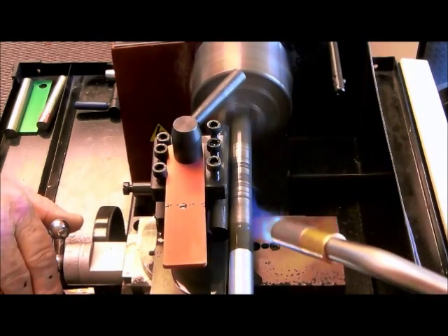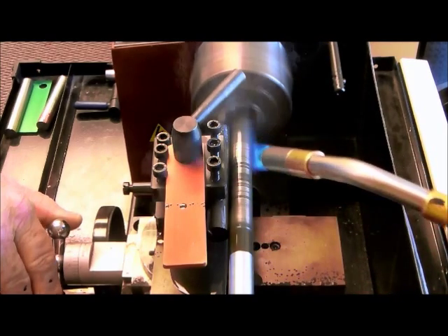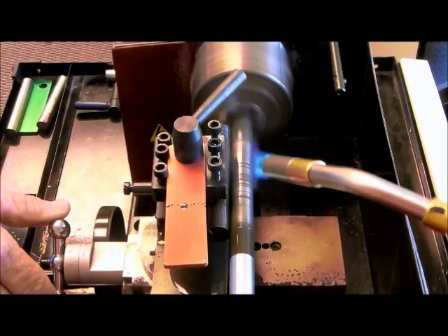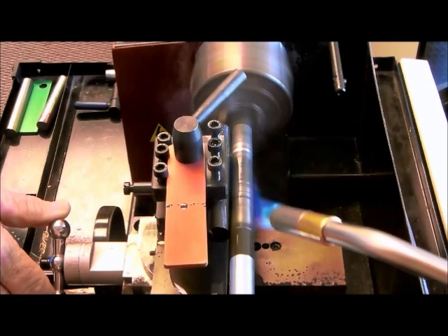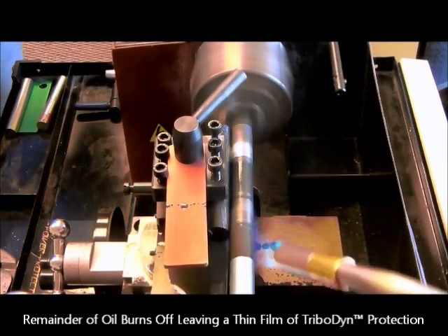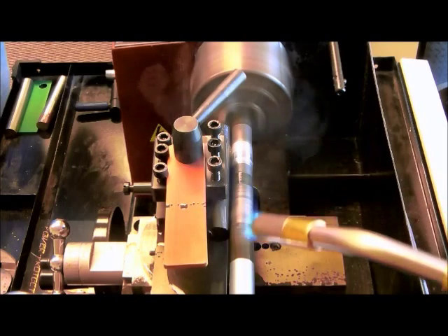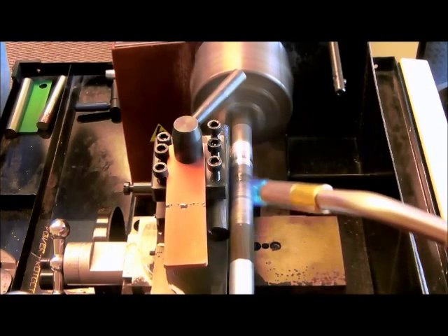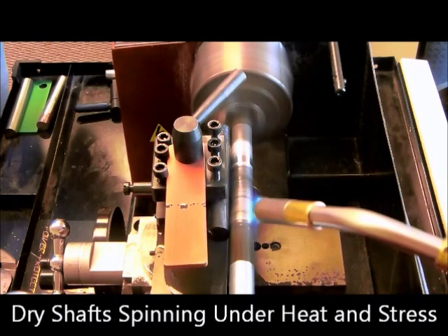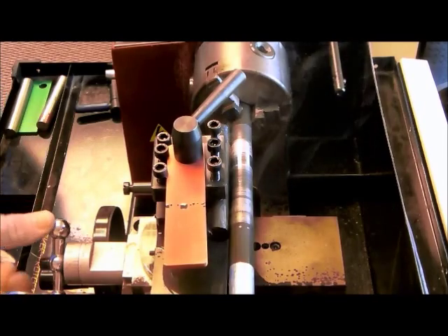At this point, the shaft speed has not changed. It continues to spin freely. If you look at where some of the gloss is on the minimal material remaining, you'll begin to see it go light gray as all the oil is totally burned out. We are running dry. Look particularly in the center — you will see the last of the material, all liquid, totally gone. The shaft is still spinning. Completely dry shaft.